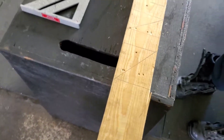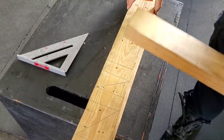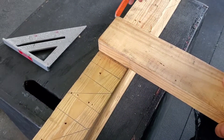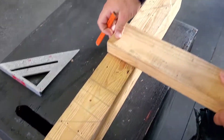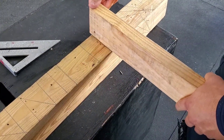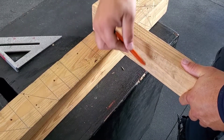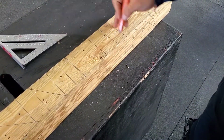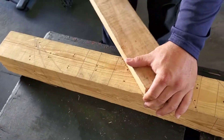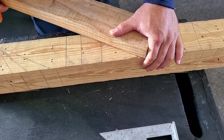This one's not going to be exactly perfect because obviously the chips and stuff on the 4x4 is going to throw it off a little bit, but it's going to get you close enough. So same thing — this time we're going to go full side once, three and a half. Then we're going to do another one full three and a half. Then we're going to come in on an inch and a half on the bottom. So we're going to connect this point to this point, take my 2x4 and go from point to point, and draw my line.